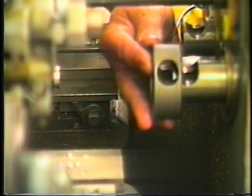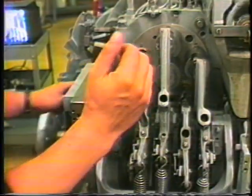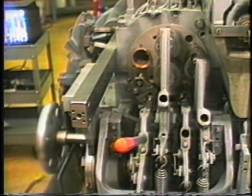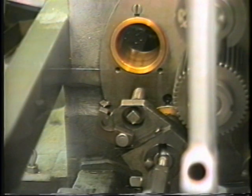Install the 671 collar and clamp on the first position spindle. Care should be taken that the radii on the clamp are positioned to the hole in the spindle. Place the cam lever handle in the first position and working cam lever and push the lever forward while retracting the stock stop latch. This will enable the spindle to retract far enough to allow for holder installation.